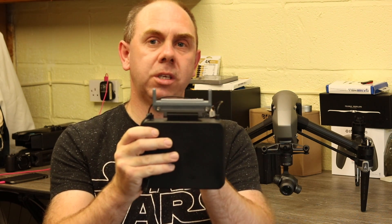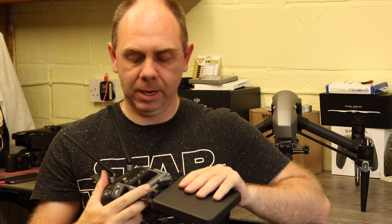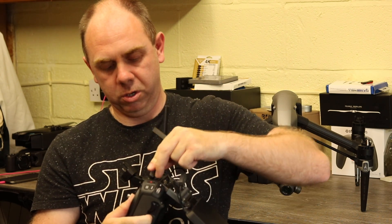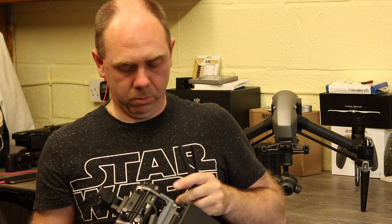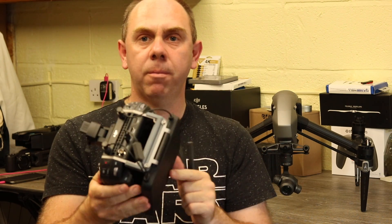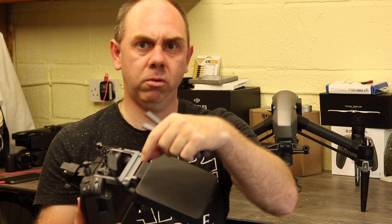Finally, I want to mention this little bit of plastic over the back of the antenna. I created a 3D-printed quick-release bracket because I was fed up using screws to put the patch antenna on and off the Cendence remote controller. To put it on I simply slide it on, give it a push, and the patch antenna clips on — I can quickly plug the plugs in and swap antennas without messing about with screws. It does stand the patch antenna off a little bit further at the bottom, but it's a minor thing. I'll put a link to it in the description for this video.